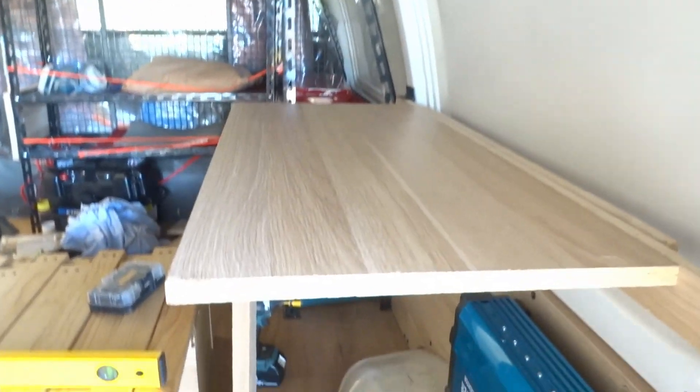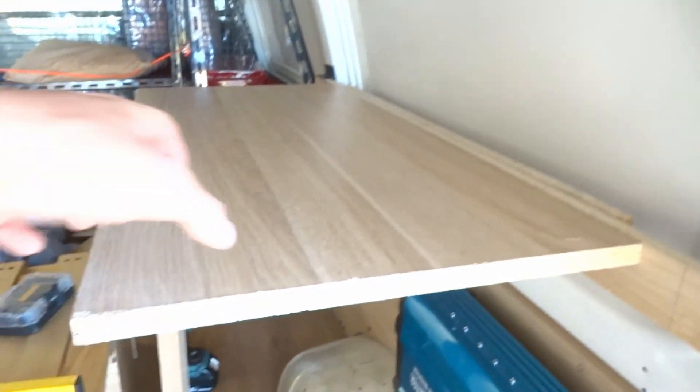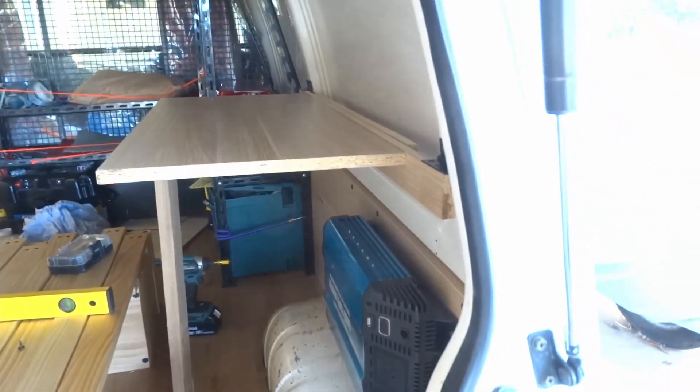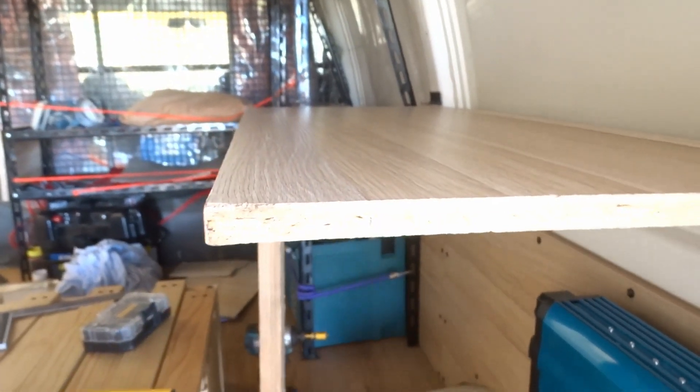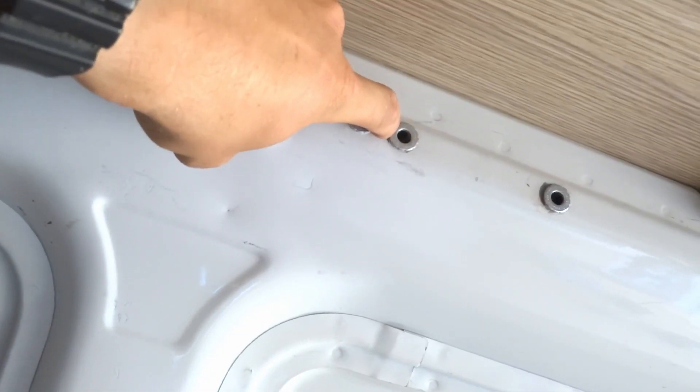That's worked for a prototype - not too bad. For the chain, I'm going to drill in about 100mm back and fix it directly above into the panel with the same screws. It's not a big table and there will never be too much weight on it, so this method should be fine. I had to go with 70mm in, drilling right in the middle. For symmetry and getting the chains looking as even as possible, I'm going directly in line from the end, straight up, which gives me a consistent point on both sides so the chains will hopefully look parallel.